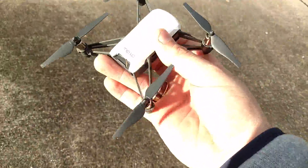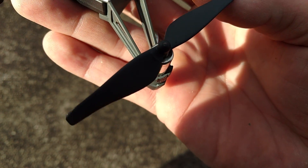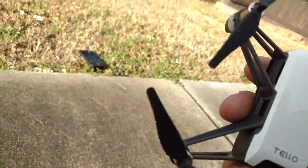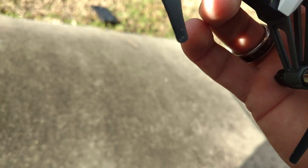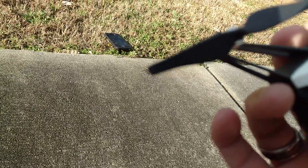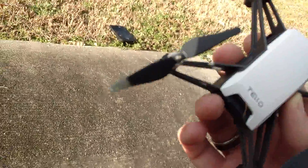I'm going to look at the third one right here — you can see it's pretty square, pretty clean. And now we're going to look at this blade, which actually was the side it was flipping over on. You notice this side is pretty clean, but on both of these sides you see that little bitty chip right there, and then on the bottom here, that little tiny chip right there. That's what's causing your problems right there.